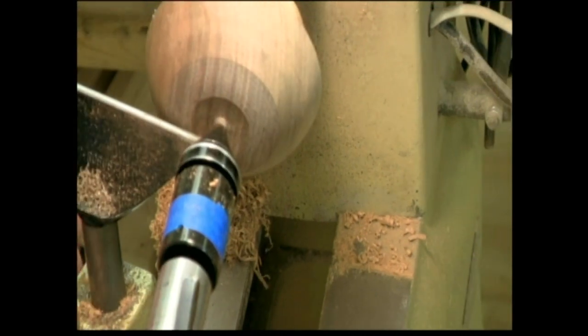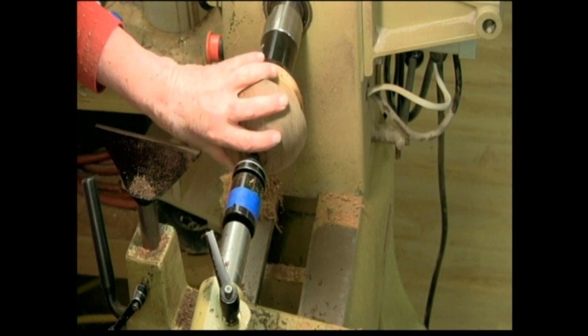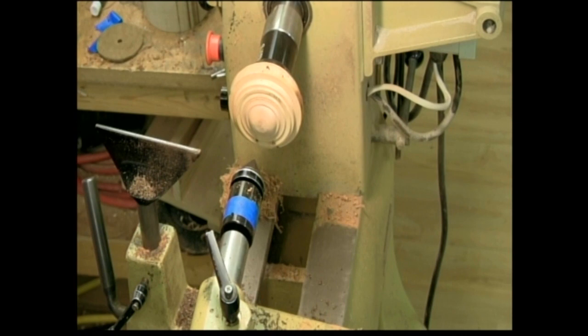So we'll do another one here. But you have to leave that hole, and that's your lineup. Does that make sense? Maybe you already do that. I can do all kinds of things. Just come in with a little hand chisel. Or actually, Betty Scarpino told me another trick one time: those little sanding foam discs, put one in your drill press, and you can clean up that bottom right on your drill.